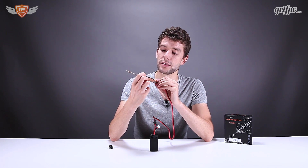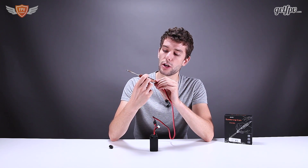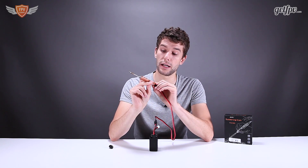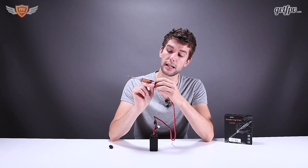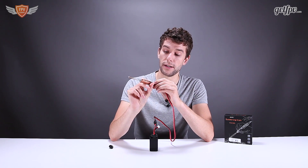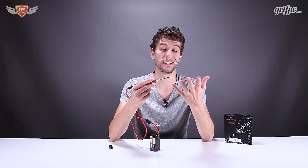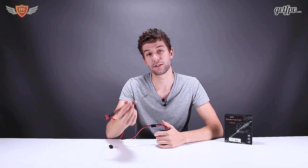Then I'm just going to hit the button, hold it in a bit, and tell it to go all the way up to 370, which is what I solder on. And there we go — I selected 370, now it's heating back up to 370 again. And I have pretty much reached my perfect heat to solder items right there, and I can start soldering on my quad.